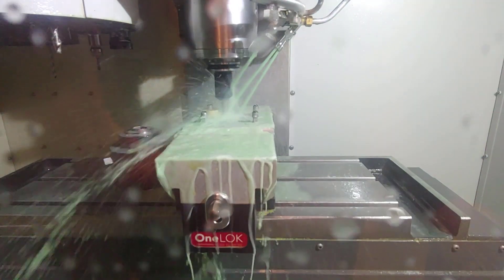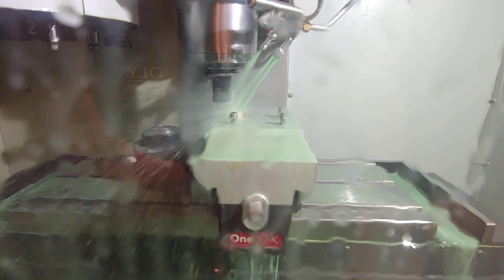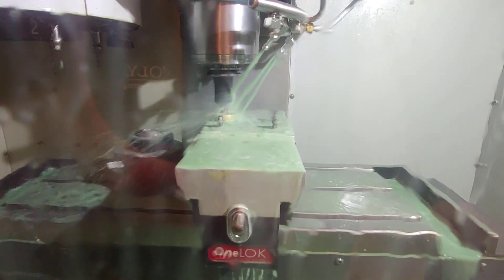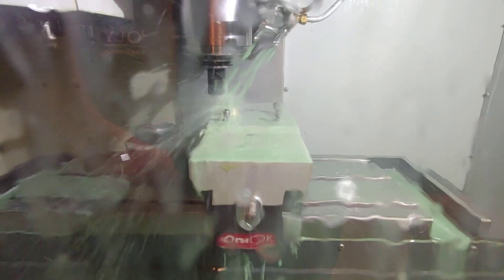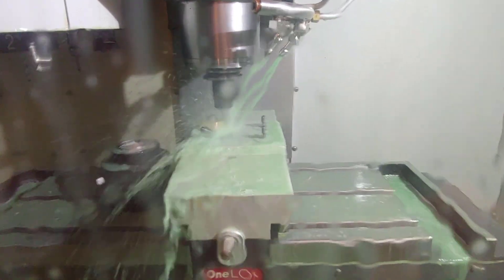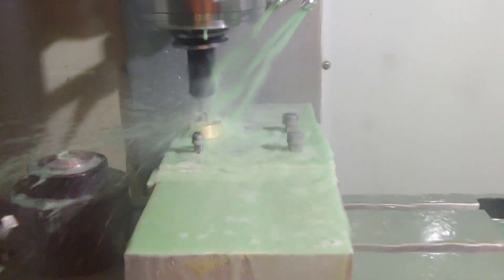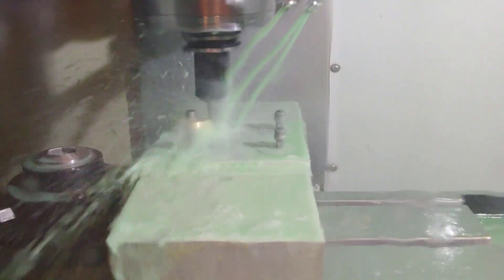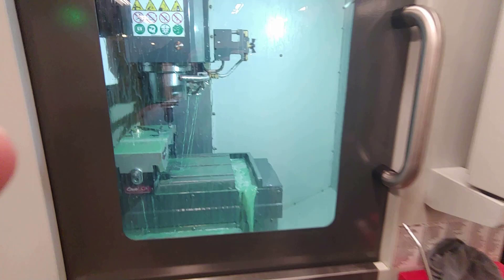During machining, we use a half-inch four-flute carbide end mill to contour around the outside of the part to get the 1.45 inch diameter. After contouring around the outside, the end mill cuts a relief into the part that has a counterbalance effect on the crank disc, allowing it to develop inertia and continue the rotation while the air motor is running. The relief is cut 0.28 inches deep. Once one part is done, the CNC program moves on to the second, third, and fourth parts. When all parts are finished, open the doors, unload the parts, and visually inspect that all outside edges have been machined and that the contour doesn't have any chatter.